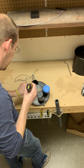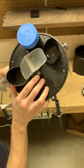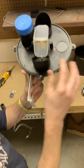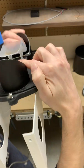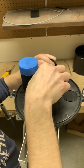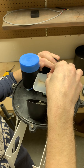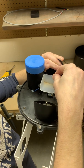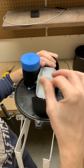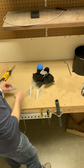That was a PH-2 for the outsides. This is going to be a PH-1 for the inside — we're just taking these two screws off, right there and right there. I'd also take note of how far away our reed switch and our magnet are, because that's going to make a big difference on whether it's actually counting appropriately. If you listen carefully you can hear the reed switch opening and closing — you have to be in a pretty quiet spot to do that. But it's once it goes past that middle point you hear a little tink each time it opens.